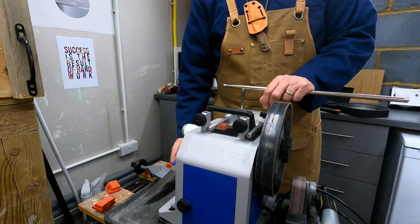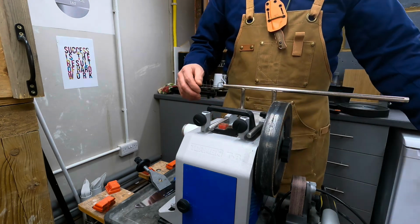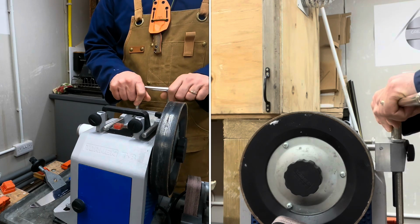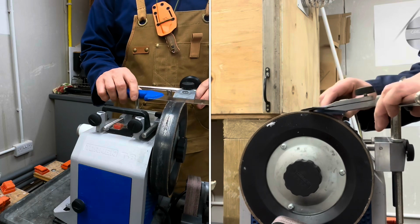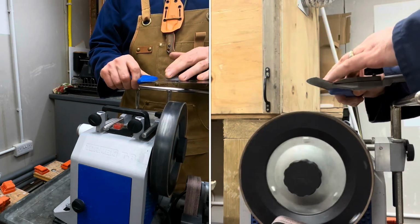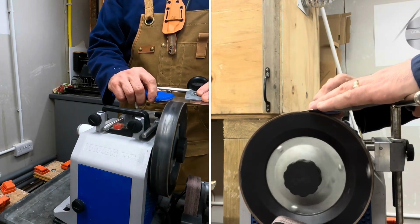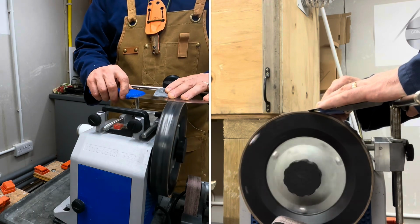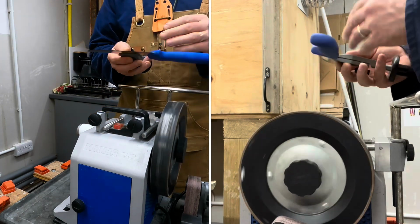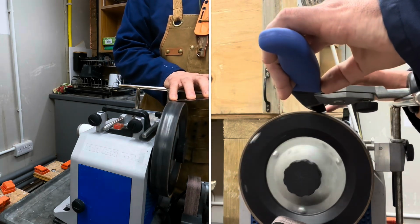Principally for me, because I like my controlled angle sharpening, controlled angle honing, I'm using the Frontal Vertical Base. I'm going to do some filming from the side angle here, so you can see a better view of that. It creates a rest for the knife jig that allows you to set up your honing at a very, very precise angle. I'm on the leather wheel at the moment. I'd already set this up. This is one of my trial knives that gets kicked around the workshop and used for all my tests and experiments. We're set up to be able to hone at 15 degrees, and I've got a nice, reliable way to be honing at exactly the edge angle and cleaning the edge up really nicely. This isn't actually a knife that I've sharpened tonight, so I'm not worried about honing it for ultimate performance. Just for demonstration purposes.